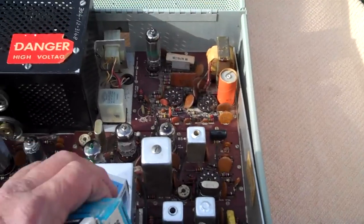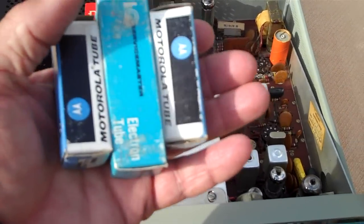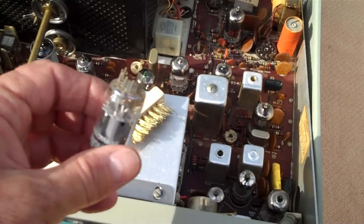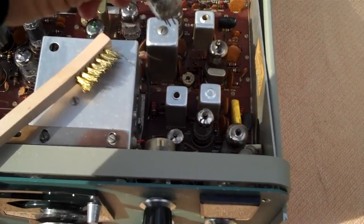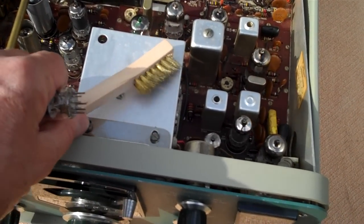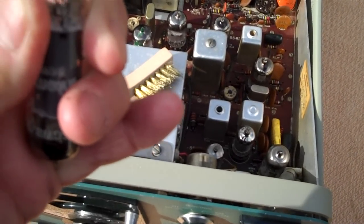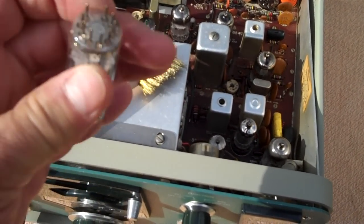Reliable Geno has sent me three NOS tubes for this rig. I'm going to go ahead and plug them in. Now, just because these are NOS tubes, it doesn't mean you want to just take them out of the box and stick them straight into your unit. Always clean the pins with a brass bristle brush — that's what I recommend. They do, over years and years of sitting around, form an oxidation layer on them, and you need to get that off. Also make sure the tube pins are straight.